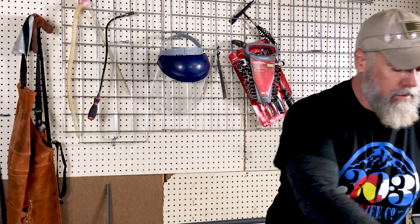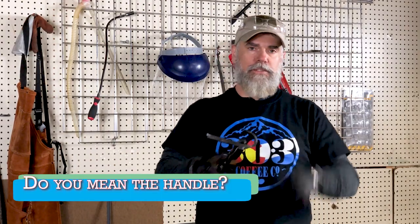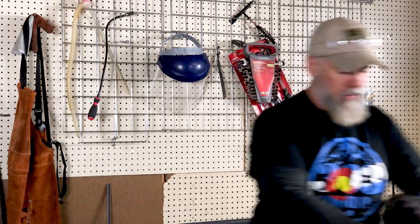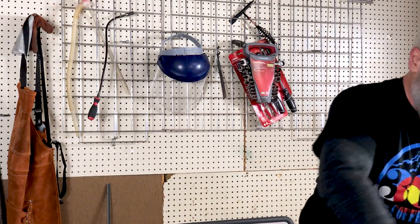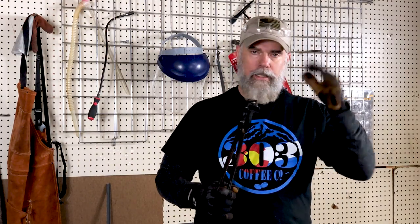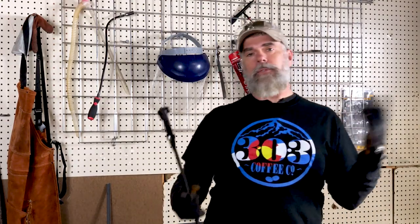Okay, well I'm done for the night, and I'll show you why. I did everything I was intending to do — I got it all forged out, but when I put my hand inside of it, the bendy bits needed to be adjusted. I heated this side up with the blowtorch and tried to hammer it down a bit, and that's when this side broke off. I guess the metal got brittle after I hardened it, and I hadn't tempered it yet so it couldn't withstand hammer blows. I got the order wrong and got it backwards, so I've got to start over.